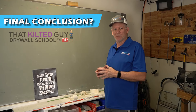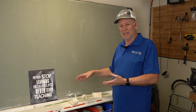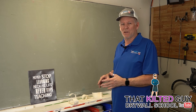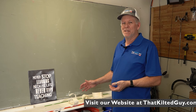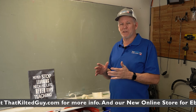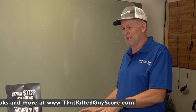My final take: it's not necessary to wet your tape. It's kind of an old wives' tale, and this test pretty much proves it doesn't stick as well — though not a huge difference, which is why many people have done it this way for years without problems. It does stick, but I'd personally want the option that sticks best. There's no benefit to wetting. If you thin your mud down right, it will wipe down just fine. If you feel wetting helps, that tells me you probably aren't thinning your mud down enough. Get good at wiping down the tape, and you should never need to wet it.